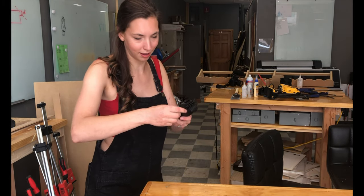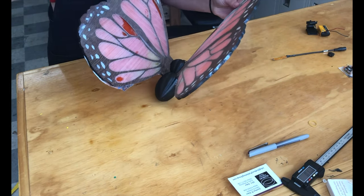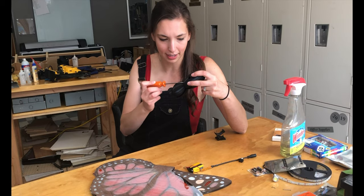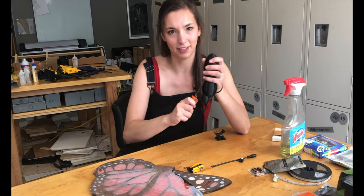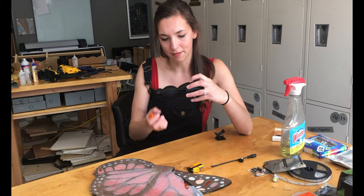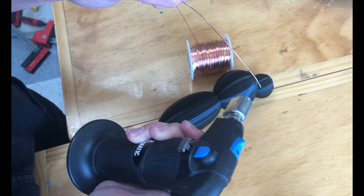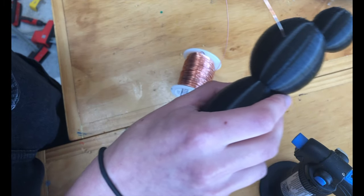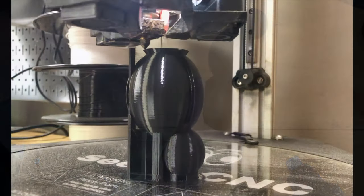I can't decide if I made it too big — we'll see. I'm noticing a couple of major design flaws with this print: the hole that goes from the LED to the battery is too small and caved in on itself during the 3D print. That's going to need to be fixed — third time's the charm. The most time-consuming part of the 3D model was adding all the holes for the tiny wire legs, so I wanted to try an alternative method. I heated up copper wire with a torch and gently pressed it into one of my 3D prints to see if it would stay in place securely. It did, so I nixed those leg holes for the final print.